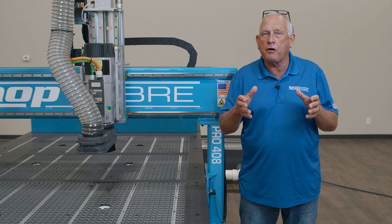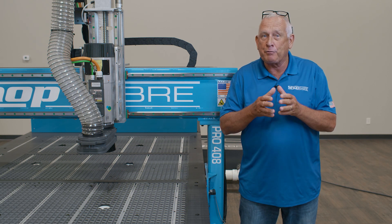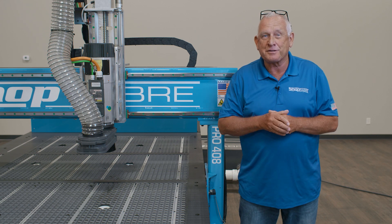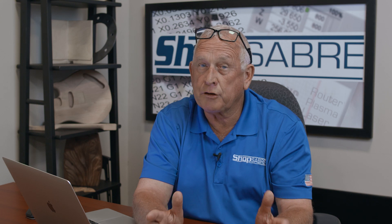Now that we've talked about the machine, let's go into the office and look at how we're going to machine an MDF frame with machining on both sides. This project had an interesting beginning — we have several banners like the ones you typically see in the background of these videos and we needed frames around them. Since they'll be painted, it made sense to make them out of MDF. Using MDF allowed us to use VCarve Pro to create any type of profile we wanted, simply by using a tapered ball tool like the Vortex 2215. The application requires machining on both sides, giving us a chance to demonstrate the use of part locator pins for backside machining.